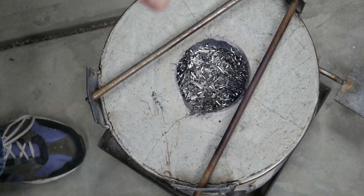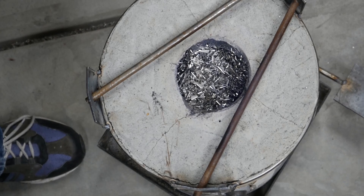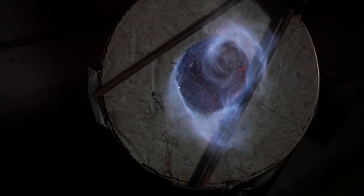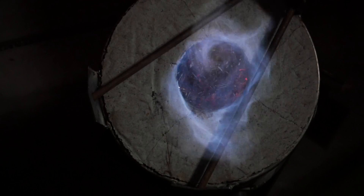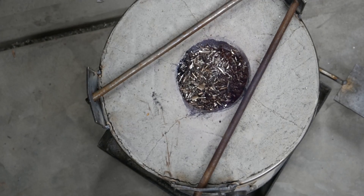This is it just after a few seconds. The flame is actually coming up through the hole. If I turn the lights off you can see it — yeah, the flame has come up out through the top of the lid. There's a vortex, a swirly kind of motion going on, so I think it's going around good. You can see things are starting to glow in there — another great sign. We're now two minutes into the melt. At five minutes in, I'm seeing a little movement occasionally — the chips are moving around. I'm not sure if it's from the turbulence or if it's actually melting.